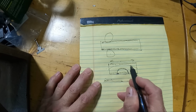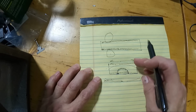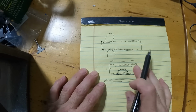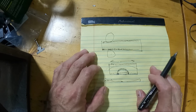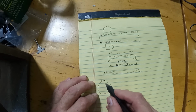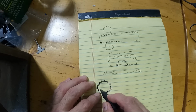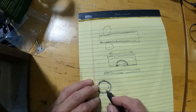Yes, it pretty much always does, because when I was cutting into this radius on this part, this force is always pushing outward and bending the part this direction. I'm no metallurgist or anything, but this is my experience, what I've seen happen when I've been machining parts. Now, if I get a lathe part, a round part, the stress is pretty much evenly distributed in the surface of a round rod or bar. But then when you start cutting away notches in it, like many of the parts I've made, you've relieved this stress and the part warps.